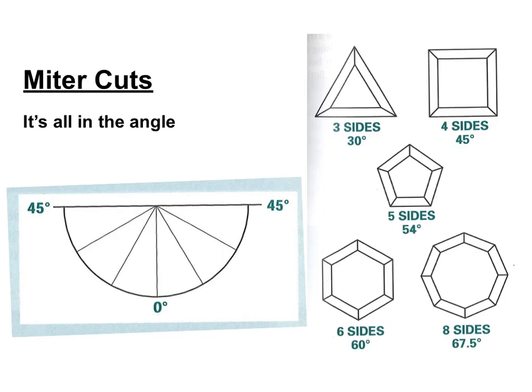What makes the miter saw so versatile is the different angles that you can cut. Most of the angles you'll cut will be zero degrees — that's probably the most common cut you're going to make. But on the sliding compound miter saw and other miter saws, you'll have little notches where you can leave the blade and engage different angles, most common being 45 and 0. Using some different angles can allow you to create some pretty creative things.